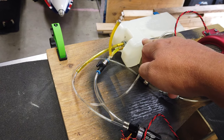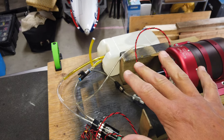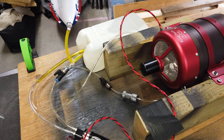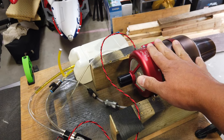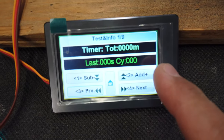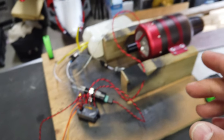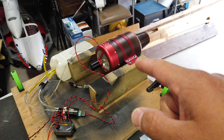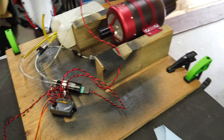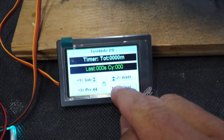All right, guys, fuel has been added to the tank. Now, one thing to be aware of here is I use kerosene or Jet A. From what I know, I think that the Kingtech turbines come set up to run diesel. Now, I've already gone through all the settings and taken a quick look at them, and they don't look like they're set up for diesel. But on the first startup, just keep that in mind, because if it's shooting flames, that could possibly be the reason.